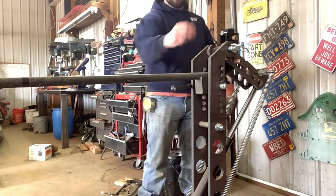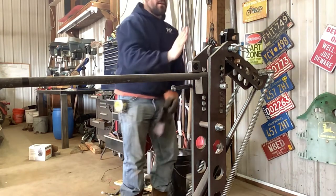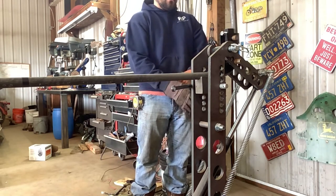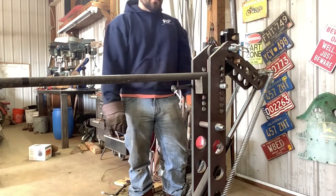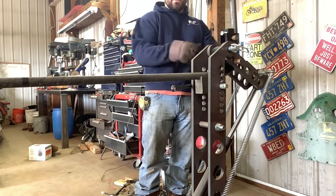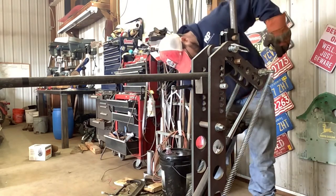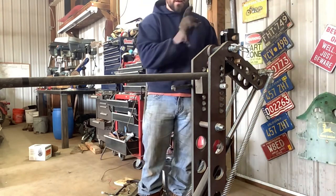I'm going to double check my zero. It looks like it's getting pretty far and it's only two degrees past. I'm at 88 on the gauge but it's actually 92 degrees, so I'll release my pressure until the pin can relax and come in and out, then check my zero again — but measure first. I'm at 12 and a half inches of stroke on my second notch.